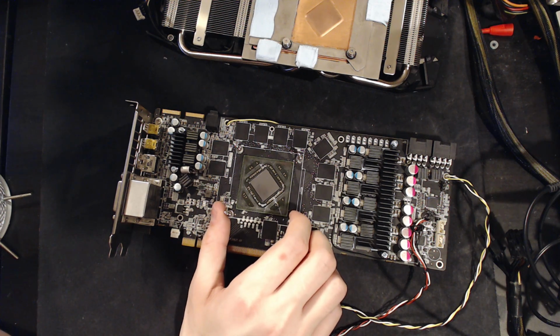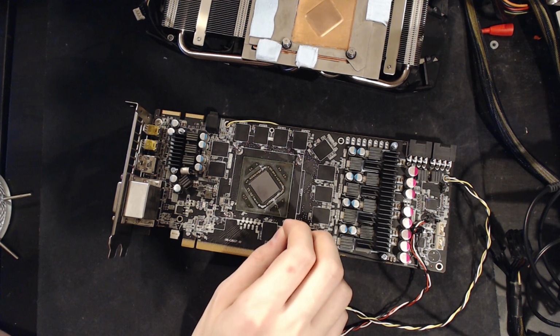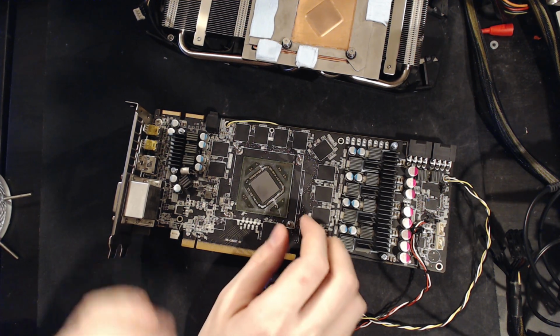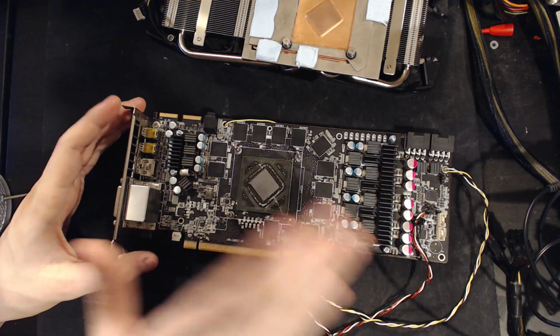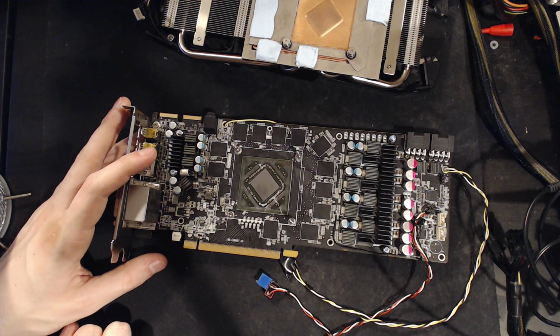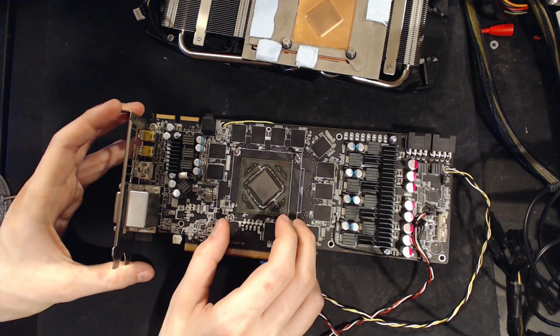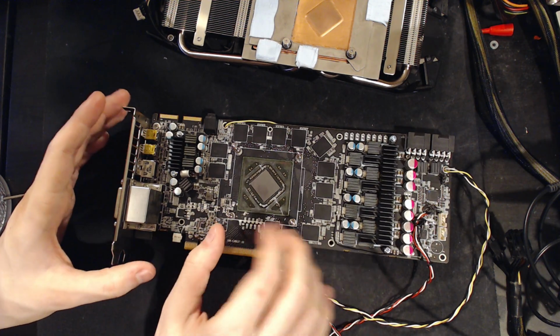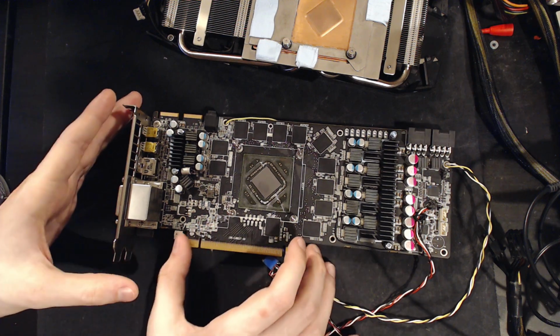As in, there's no liquid nitrogen in any of the dewars anymore. We need some other kind of coolant, and dry ice seems like a pretty viable option. Plus, it's really easy to work with compared to liquid nitrogen. None of the constant babying of the temperatures, because dry ice isn't cold enough to cause cold bugs and other issues that liquid nitrogen does cause. So, that's planned for this card.